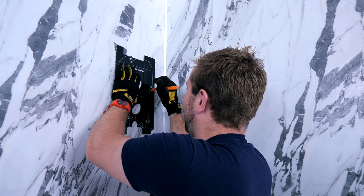Word of advice: once you come to putting the head on, put the head on now and get it tightened before you actually put the arm on, because it just makes life a bit easier. You should not have to get a set of grips to do that up, but you never know. Because you're not going to be able to see it in a minute, just pop the grub screw in and give that a thread or two now. They actually supply extra grub screws and extra O-rings, which is something they don't need to do — it's nice that they think about that, because we plumbers can lose things. Make sure that the grub screw isn't too far in, as it can damage the seals if it's over-tightened. The head direction can actually be adjusted — so for instance, if the riser was in the corner of the shower, we'd be able to move the head so it was diagonally pointing out. And that's our head and our riser in position.